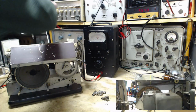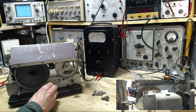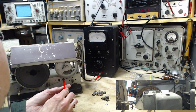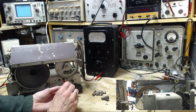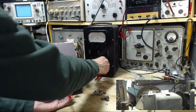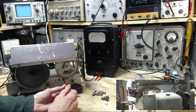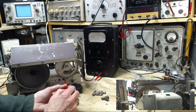Okay, that didn't seem to make any difference. Popping that open. So we tune the radio so we get the absolute peak on that meter. There we are. And we'll go at this guy. Okay, here we go. Watch the meter. Oh, down. Oh, that's nice. Oh, I like that. So this is against the coil I built, and there's the peak. Beautiful. So we'll go back to the peak. There we are. Excellent.